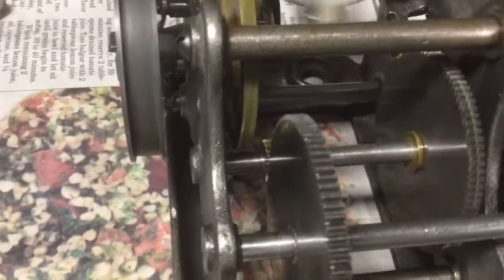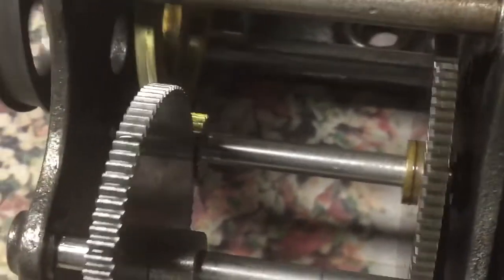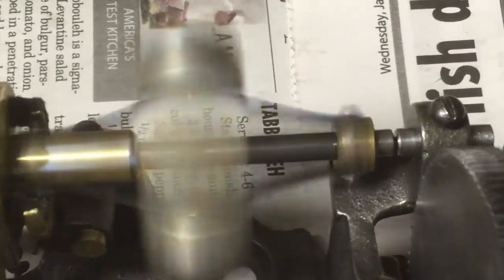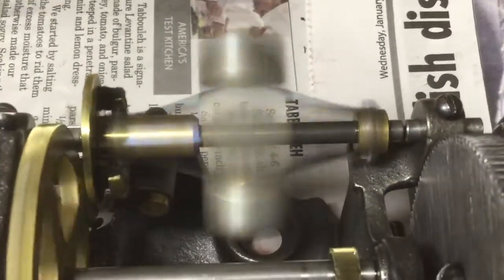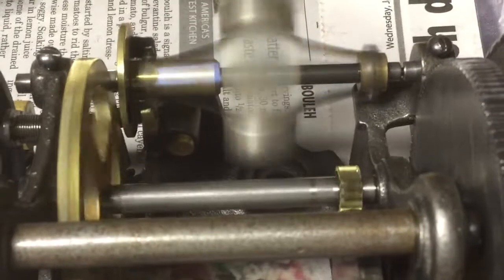So this is a pretty good running motor. The repair on the cracked pinion was successful and it looks very nice — once the motor is installed, it will be very hard to tell that it had been repaired. The governor has been cleaned and repaired, although it's not quite the same configuration it was with the torsion spring. I believe it will work just fine.